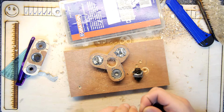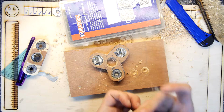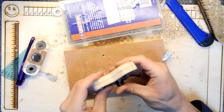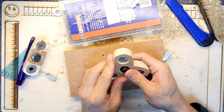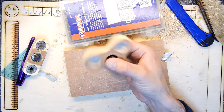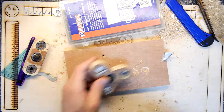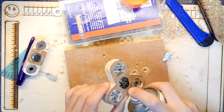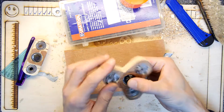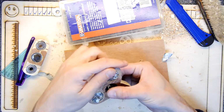So you need to get rid of that grease, and to do that I would advise a spray type lubricant, and I have one with me here, so we'll show you the before and after with the lubricant. So we'll pop that through. Again, not quite what we'd like, but look at that, it's working, right? That's spinning pretty pleasantly. But if we take the lube now, and this is a silicone based lube, but it's even better if you use an oil based one like WD-40 or whatever. Other lubes are available, of course, but look at this now.